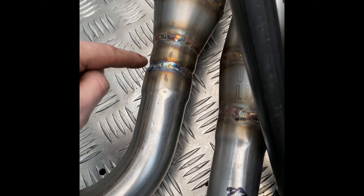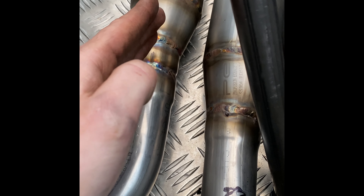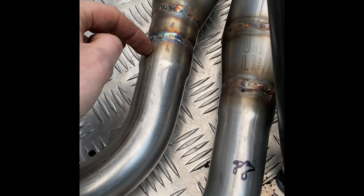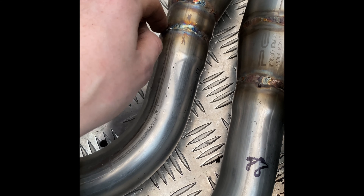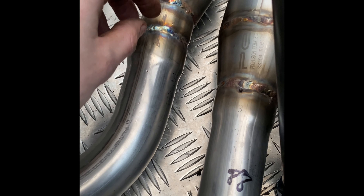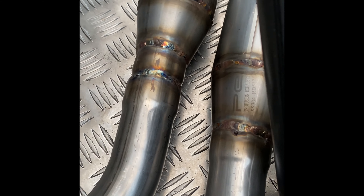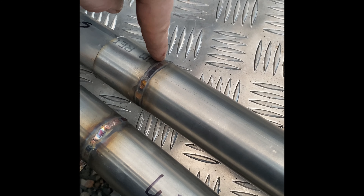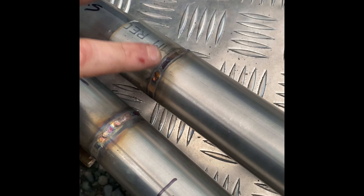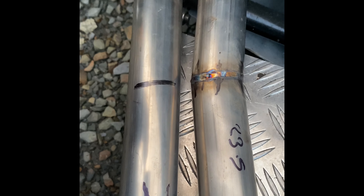The bike's back together and running again. This was the final weld — it didn't come out as great as I would have wanted. I had to put a slight kick back on it, utilizing a bit of a slot in the tolerances between the two pipe sizes, and that left quite a large gap. If I'd taken more time and fitted everything up a little better it would have looked nicer, but it's my first time doing it. All in all, pretty tough going on these last couple of welds compared to what I did on the first day — really happy with those three early ones.